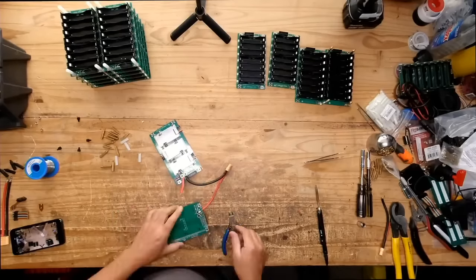So those are not power cells. Those are just kind of like energy cells. They're not even energy cells. They're just kind of like middle of the road cells. But they're good enough to power like a little scooter, right? So I think they can do 10 amps without getting too hot. So they're right in the middle. They're perfect for doing power walls. I would like for them to have more energy, be a little bit more energy dense.